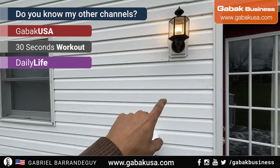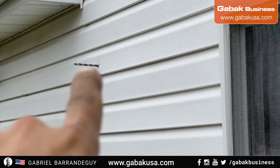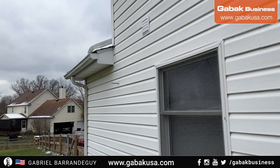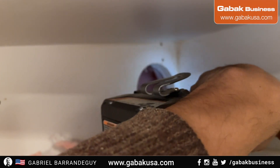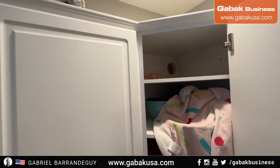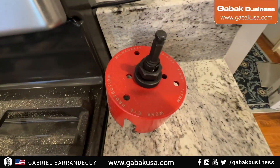As you can see, we are outside now. We have another vent here from the bathroom. I used a long drill bit from the inside so that I know the center and then I can make the hole from this side, because making the same hole from the inside would be way more difficult. The hole size is four and a quarter, as you can see, and I'm going to use that same size outside — or if you have a brick you can use that one.